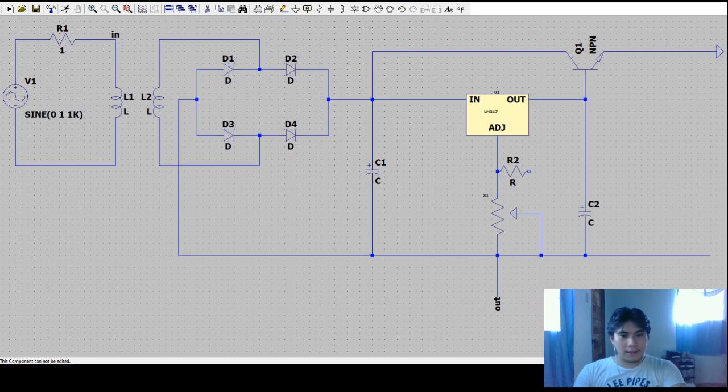I'll set the source with an offset of zero, an amplitude of 20 volts, and a frequency of 50 hertz. The resistance I'll make 1K ohms. Now, to make the two inductors act as a transformer, we need to couple them. Press S, click SPICE directive, and type: K L1 L2 = 1, meaning both are equally coupled.